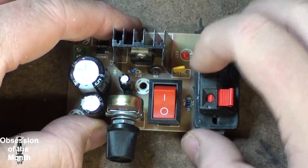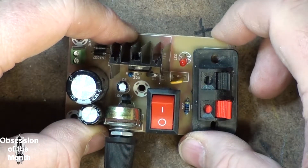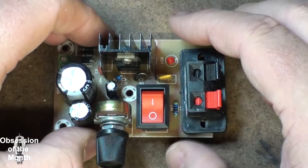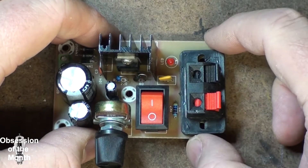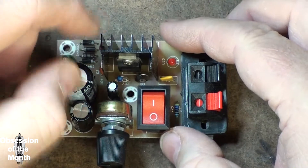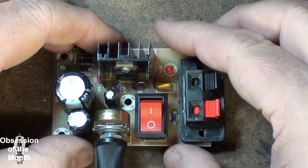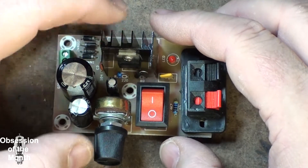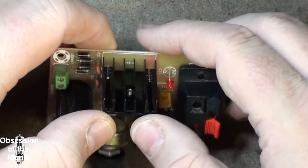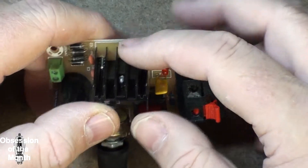The other thing I've noticed is this one has one of these little resettable fuses on here — that's what this little brown thing is. Unfortunately I can't read the writing on it; it could be an amp, might be 1.5 amps. The voltage regulator, the LM317, can only handle 1.5 amps max. Also, this heat sink may not be adequate enough for 1.5 amps for a long period of time. I'm not sure how to tell exactly how big a heat sink needs to be to handle 1.5 amps, but I think it needs to be a bit bigger than this.